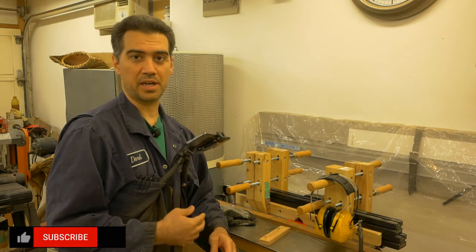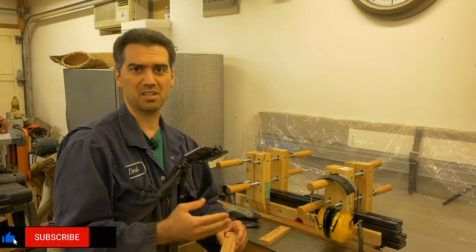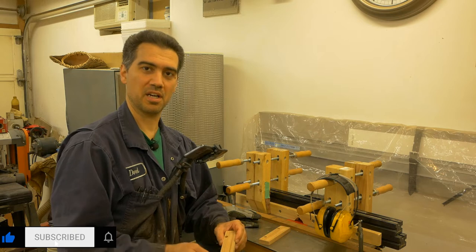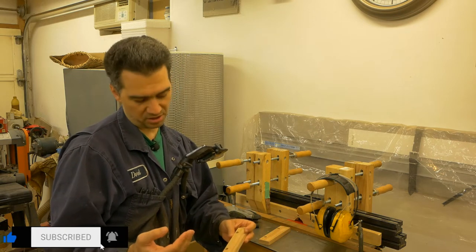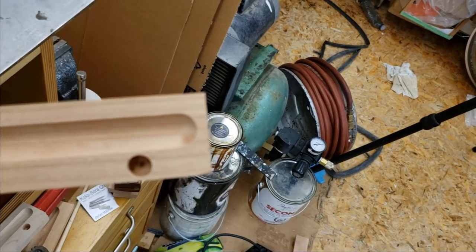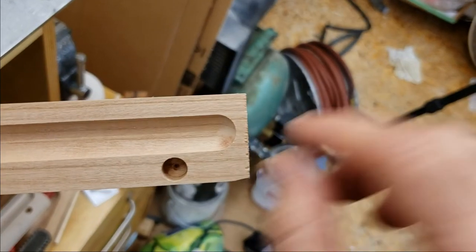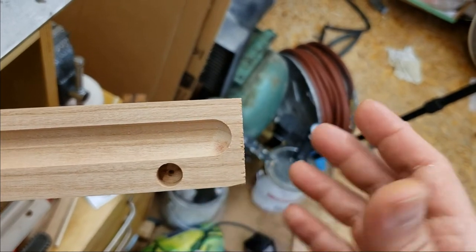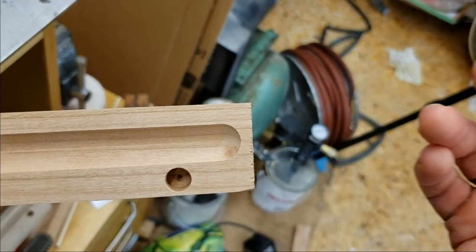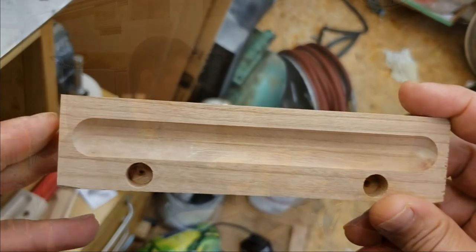And this is the entire process. So I gradually lift up the router bit to my height, and I usually do about a millimeter at a time. Now, for demonstration purposes, I was a little bit more adventurous, and I think I did 2 millimeters. And as we can see right here, this is, let me just focus it. Come on, get in focus. This is one of the scorch marks I was referring to a little bit earlier on. So as I keep raising the bit, and then finally I use the final fresh bit, that would technically disappear.